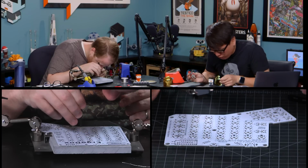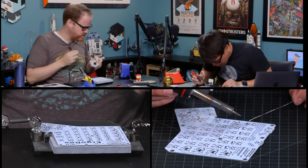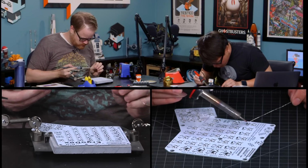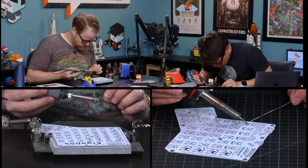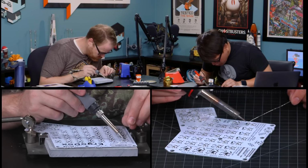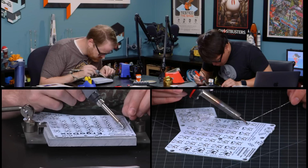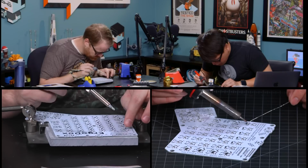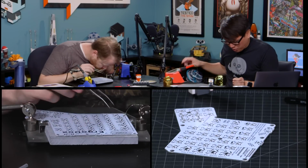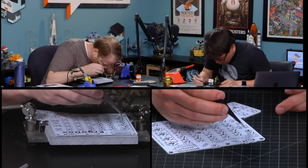This tip is really a fat cone. Okay. I'm gonna have to rotate this. There's another one of those Weller soldering irons with a probably finer tip even, if you want. Jeez, no smoke. I don't want smoke. One of the things you can do is tin the pads. This is going to be very, very difficult. This is hard soldering. I think once you get a rhythm, it'll go fast.